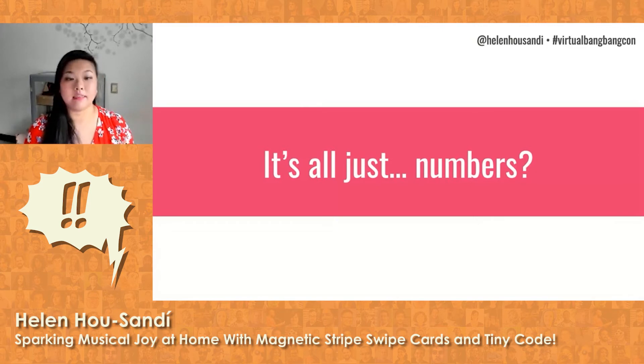I decided I would encode just a number onto the second and third tracks. This also did not work correctly the first time — I guess maybe the amount of data is too small or something. So I had to encode each number with three digits, left-padded with zeros as necessary. Our favorite thing: left pad. I also decided to encode the number onto all three tracks just to be super sure that it was there. So now that this was working, I was encoding the card with the card writer with the number on all three tracks and then reading it with my card reader.